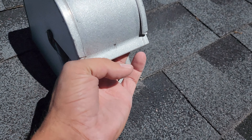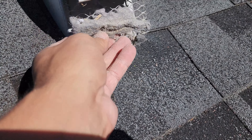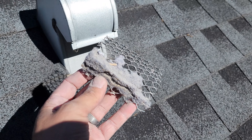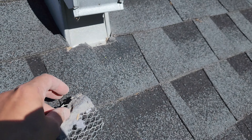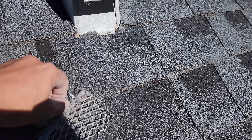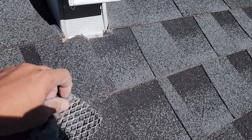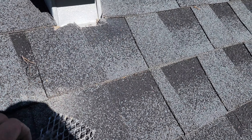The last thing I like to do is go up onto the roof, find the vent for the dryer exhaust, and take out the mesh metal so I can clean it off. Just take a brush and brush over it quickly, then make sure there's no other debris in the vent flap. Go ahead and put that back together and you're good to go.